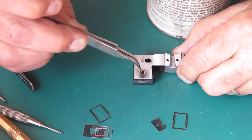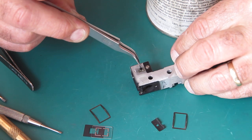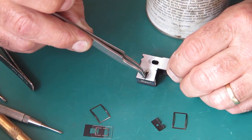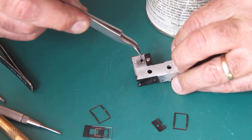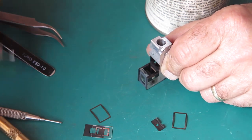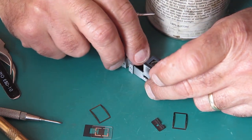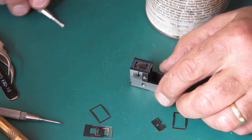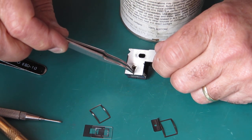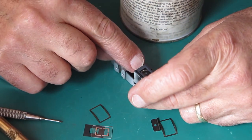All that's wanted is a drop of acetone in there, and the same at the top in the same position. We've usually got to do it more than once to soften that lacquer. Typically what I do is I can see the edge of the mask between the two pieces of glass — I just flick that with my fingernail to see if it's coming loose. Don't force it, you'll end up breaking one of the pieces of glass. So I add some more acetone — try again — yes, that immediately shifted.